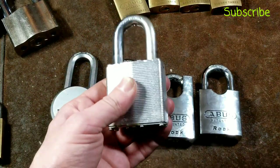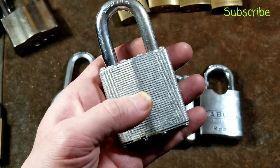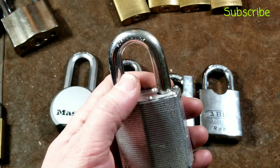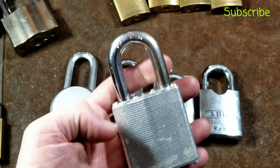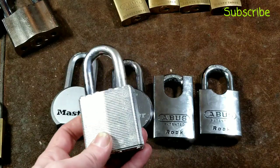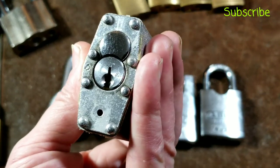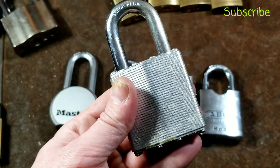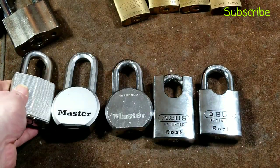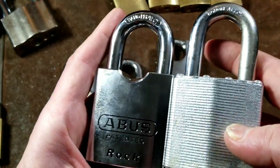In that firefighter video, they showed this lock could take a beating. These Abus locks are much stronger, for a couple reasons. Master locks on these pro series use brass locking cams. The 83/45 series has nice large cutouts and very large ball bearings — that's one reason I don't recommend American locks even though they're physically nice. American locks use really small ball bearings on their 7/16 locks, and there are actual firefighter videos of them breaking into those pretty fast just because of the undersized ball bearings.